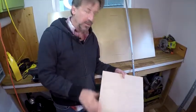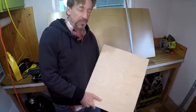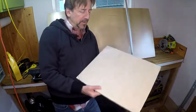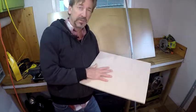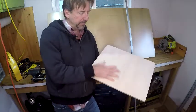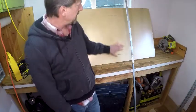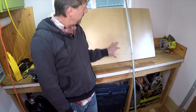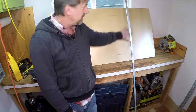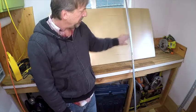This job really only involves two materials. You've got veneer board, which is basically plywood — plain old furniture grade plywood on the inside with a factory-applied veneer on the outside, such as maple on top and maple on the bottom. This one is unfinished so it would need to be finished. Here's another kind — this is birch, also plywood with birch on top and birch on the bottom. The difference is you can see a little gloss here; this one has been finished, so there's not much for me to do after the tray is constructed.